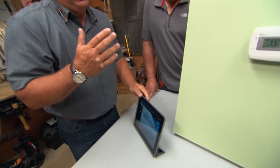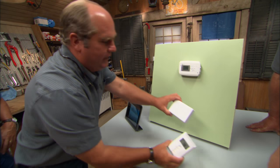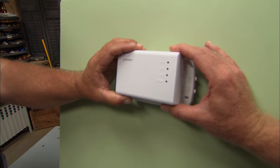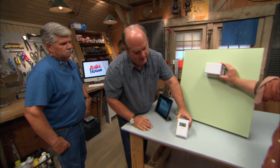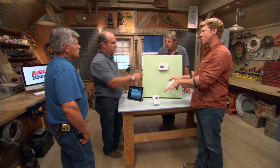So if you don't need the internet, there are some other alternatives. Say you've got a thermostat in the wrong place — they actually make a unit that's a bit simpler with no internet connection. You would take off the existing thermostat, connect the five wires behind it to this receiving unit. But this is not the thermostat — this is. So now you could take this anywhere you want, hang it on the wall, or in a commercial space just sit it on someone's desk and they'd be in control. Because you're connecting it to the existing thermostat wiring, you do away with all the rewiring down in the boiler room — it's only done right here with these five wires. It really is simple.